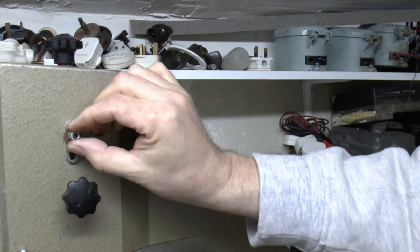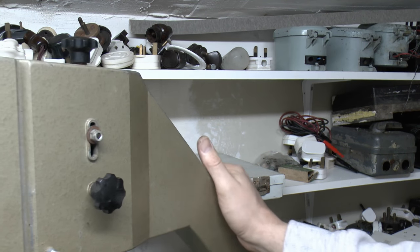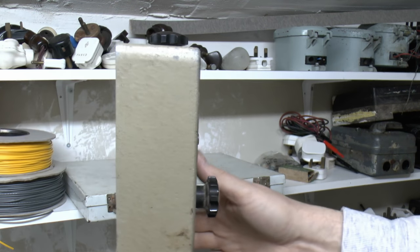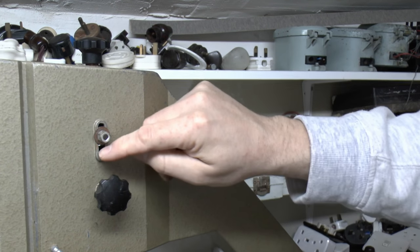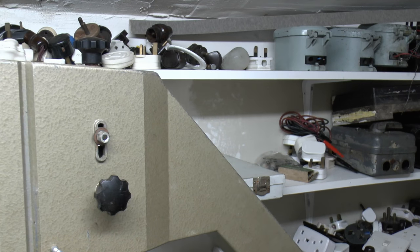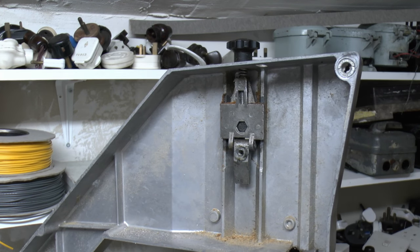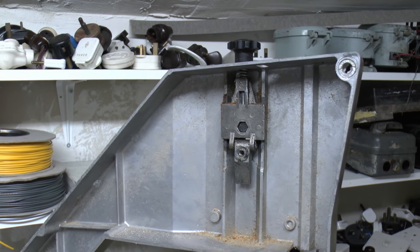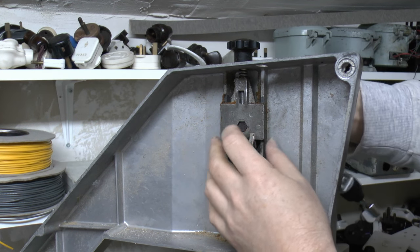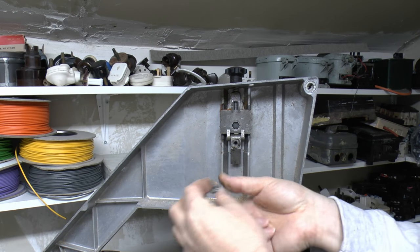That's kind of where it was, and the blade was still horribly loose, so maybe that blade is actually the wrong length. And it's obviously, if it's too long, then you'll never be able to tension it, considering it can go all the way down to the bottom of that slot. So it may well have been the incorrect blade altogether. But we're getting a new one anyway, so it doesn't really matter. So just taking the nut and the washer off the back.